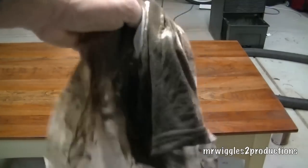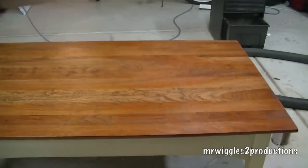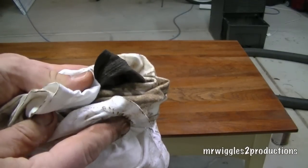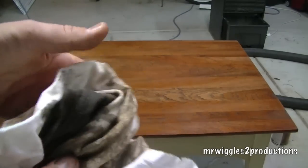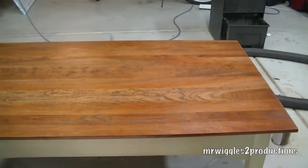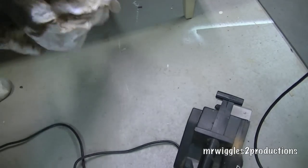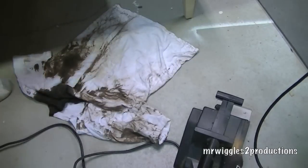This is what we're left with — a dirty rag with oil on it. You do not ever want to ball it up and throw it somewhere when it dries. Any oil will gather heat as the drying process occurs; heat is the byproduct of the chemical reaction that takes place when it dries, and you'll have a fire. So we open these up and just lay them straight out flat on the concrete where they can't do any harm. When you find them the next morning they are generally shriveled up as the heat pulls them together.